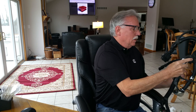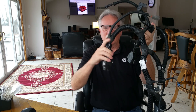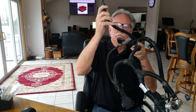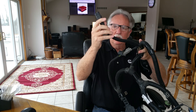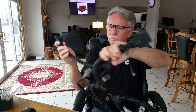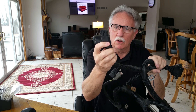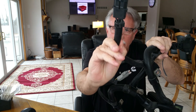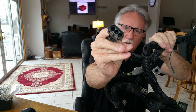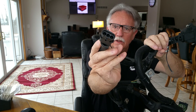This here is an M11 Select Plus harness, but the plug is the same whether it's an M11 or N14. It runs down a little bit from the ECM plug — the N14 might be a little longer. As you can see, it's 12-gauge wire and it has a weather pack connector made by Delphi.